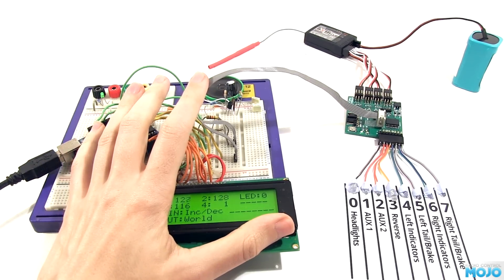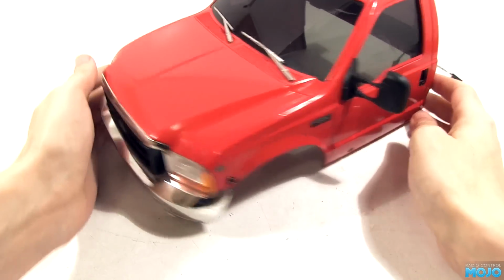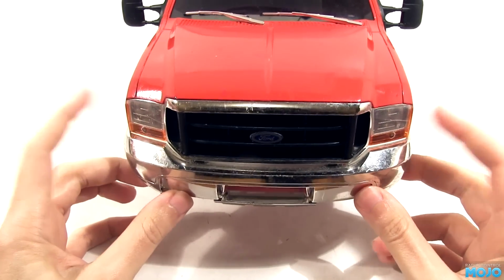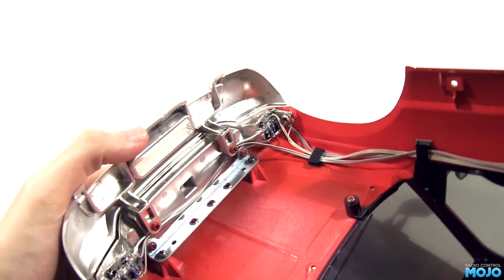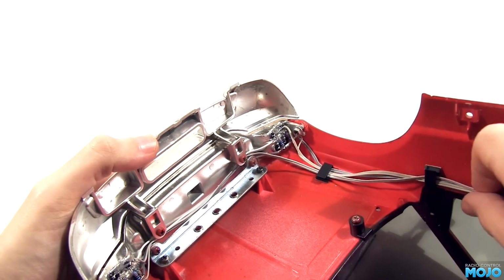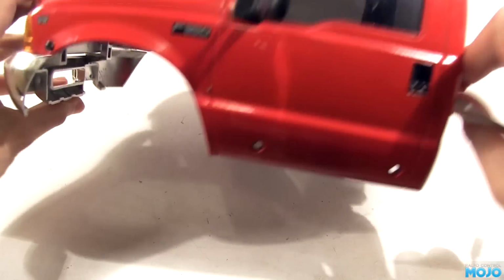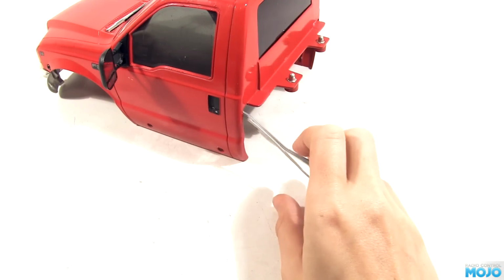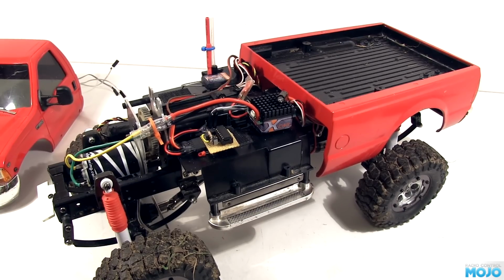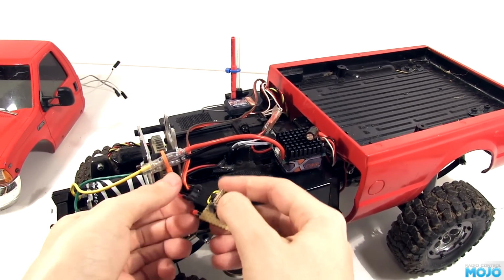Okay, we looked at the board, but to really get an idea of what it's all about, you really need to fit it to something. I'm going to use the F350 for this, mainly because I've already installed the LEDs. The important thing here is this controller is not compatible with the Tamiya LED strings. It will do damage to them. Each LED needs its own resistor, but you can parallel up 10 or 12 per channel quite happily, whereas the usual controllers limit you to, well, 2. Anyway, the wiring of the LED is pretty much as the video we made a while ago on LED basics. I'll pop a link in the description.